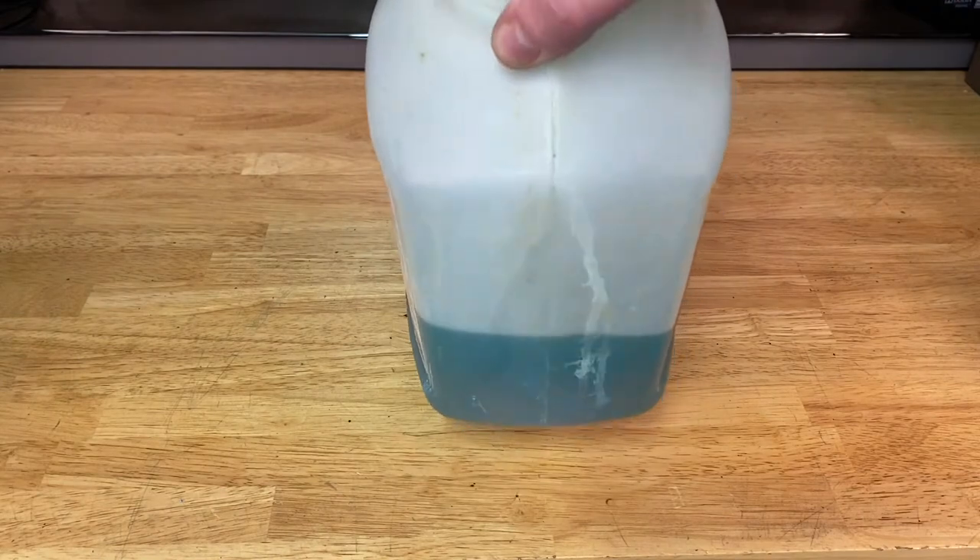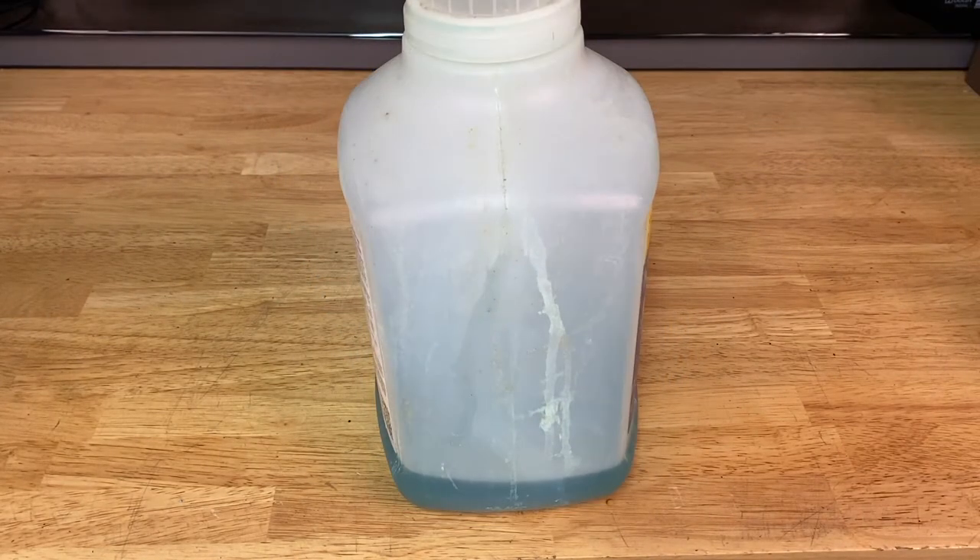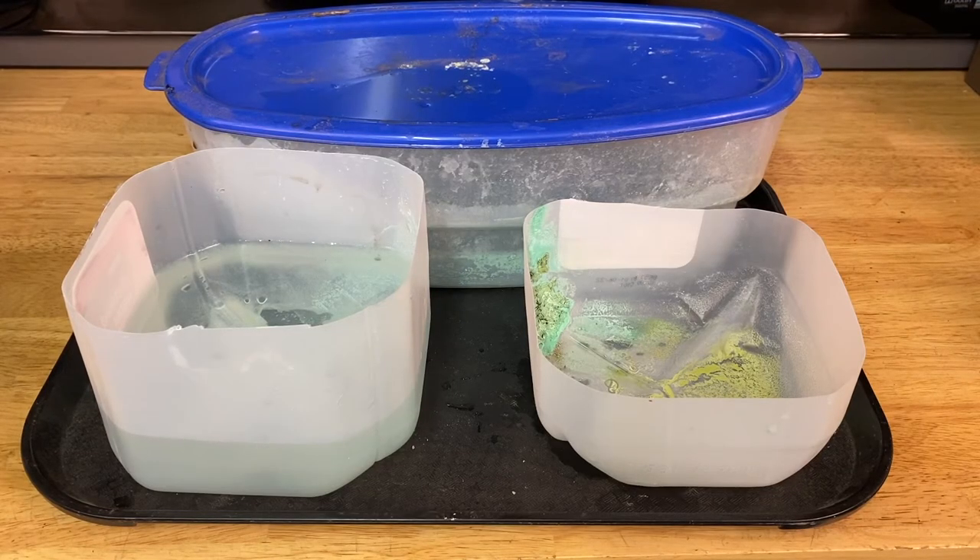As you can see, it's this beautiful blue-green color. As soon as you add your aluminum to the etch, it's going to go from a blue-green color to a muddy green color to a gray type of color. Once it gets really dark gray, you know you're getting towards the end of the life of the etch. I like to work with trays, especially when working with chemicals. This is a simple plastic tray, like a lunch tray. In the back I have a larger container for pieces that are too big. On the left I have some water for rinsing — as soon as we start to etch, there's going to be a red material that starts to bubble off, and we want to put the piece in water and rinse it off.